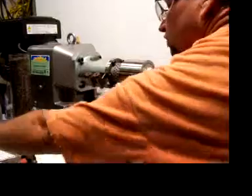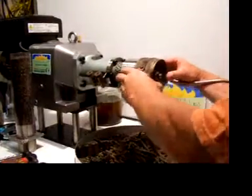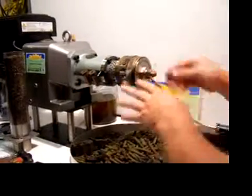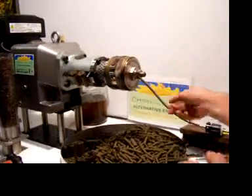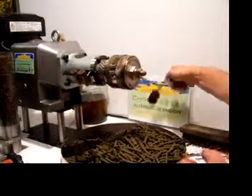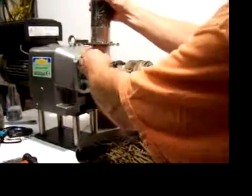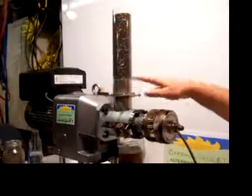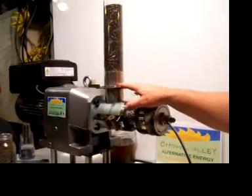To start this unit, we can use a heater to preheat it. Once the barrel is up to temperature the heater isn't needed, but it does facilitate starting easier. So we can actually plug that in and warm it up. I have to install my seed supply, so I will start the heater, and when we go to start the press we'll do another video.